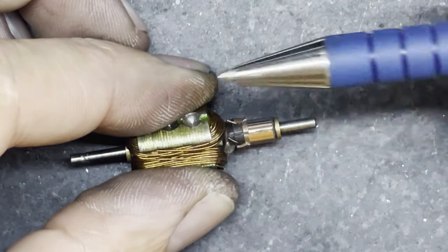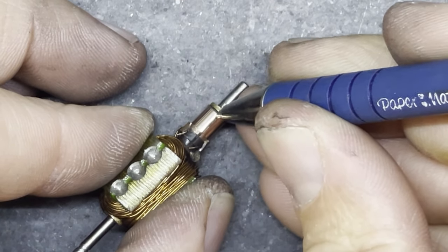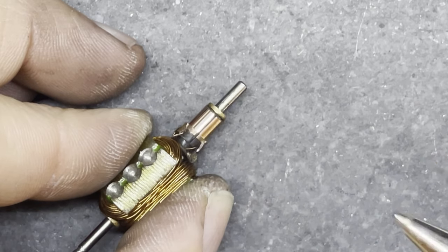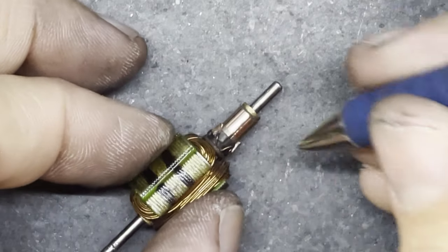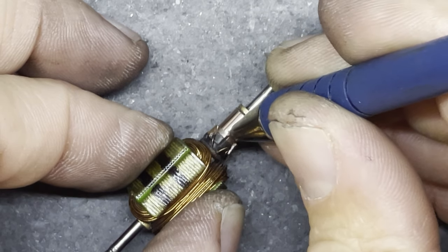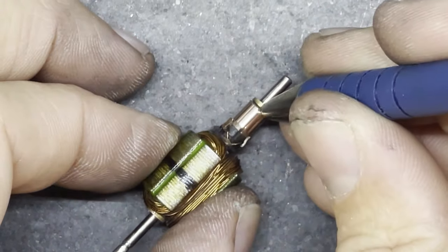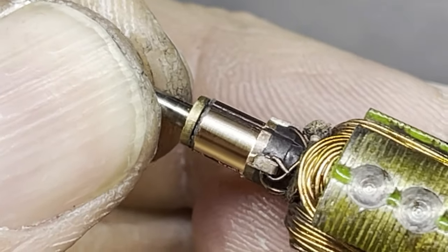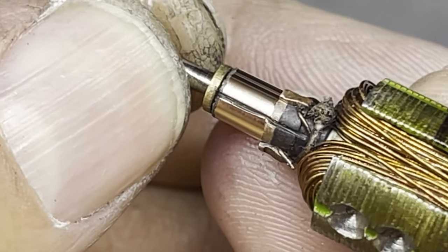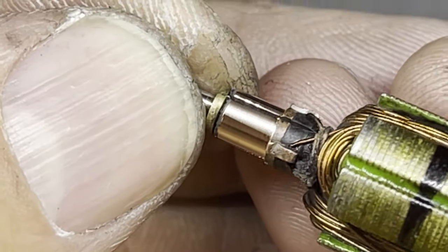The little trick to fix that is to take an old ballpoint pen, one that's run out, and then very carefully run the ballpoint pen along the comm slots. It just cleans off the edges of the comm slot and the ball of the pen radiuses them off ever so fractionally, taking off any burrs on the edge. You have to be careful not to run over the comm itself because you don't want to put an indent in the comm. When it's done you can see the edges are not rough anymore — they're nice and radiused. Not by too much obviously, because you don't want to widen the comm slots, but you end up with a much better finish on the edges of your comm slots.